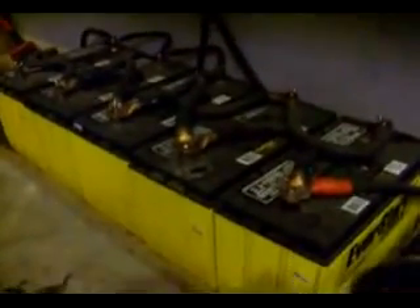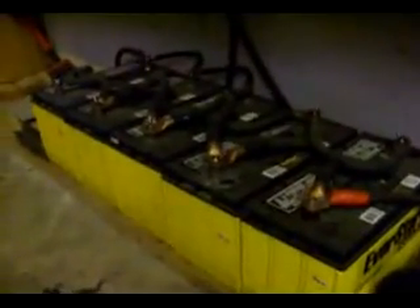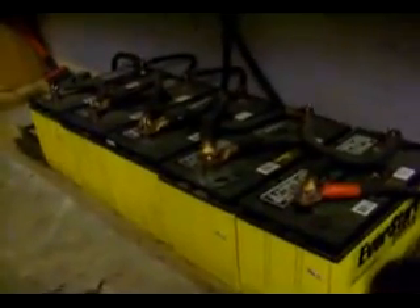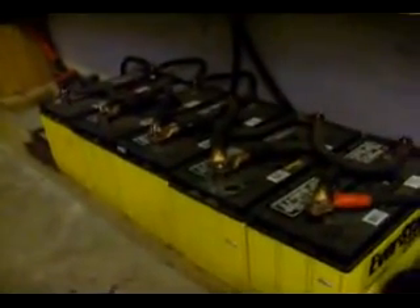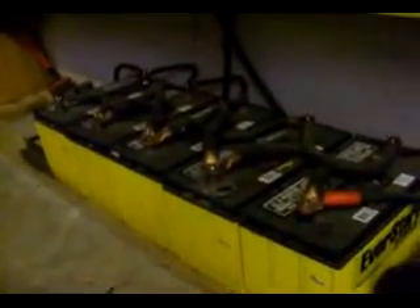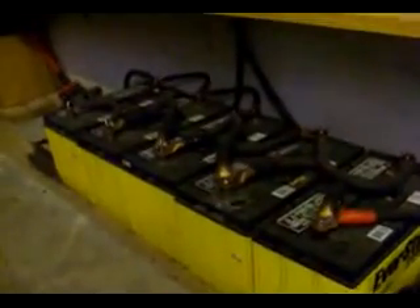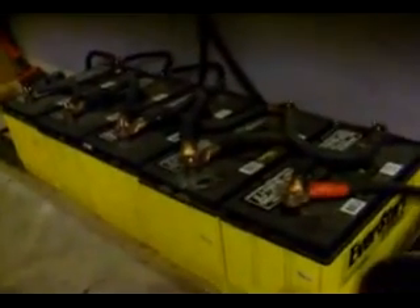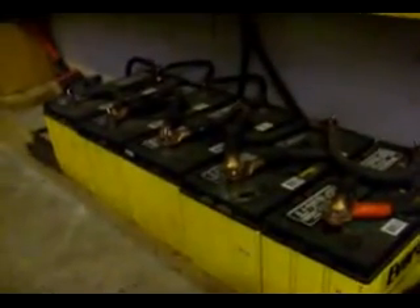They're low maintenance. Some things people do is use car batteries or truck batteries, which I am guilty of out in my shed, but that is not a critical application. You have to use some sort of deep cycle type of battery or marine battery at least. These cost about 70 to 80 dollars at Walmart. One thing you do have to remember is the negative side of your battery bank, if you're doing this for large scale, has to be grounded to earth through a ground rod.